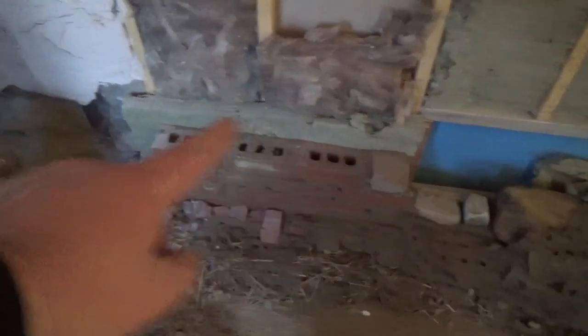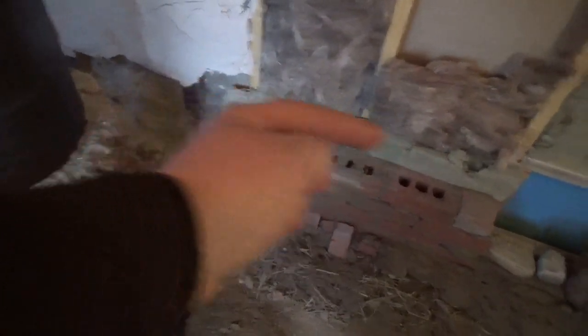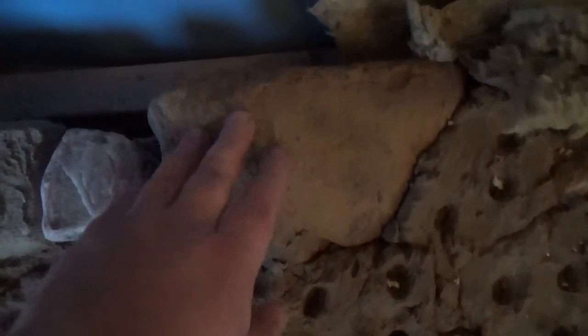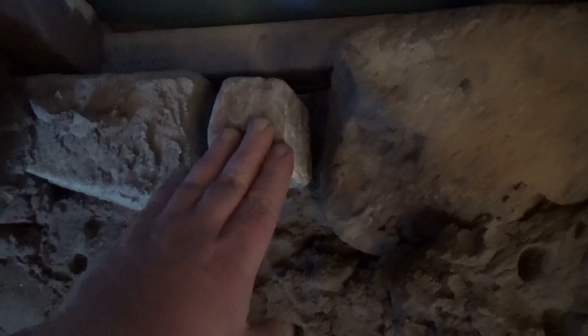Progress with the bench: I've built this section out of brick to keep it really snug against that wall, because there's going to be a duct coming through here, and I've put some rock wool behind it to act as insulation between that and the stud work behind. But this side of it — where it's visible through to the bathroom — I've made it out of really nice stone that'll be visible on the other side eventually. This bit is the only section that hasn't been mortared in yet. The slab that runs underneath this stone keys into that brick wall, so the whole lot isn't destabilised.